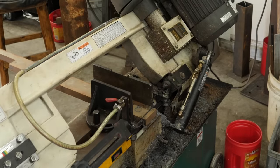Now that the guard is fit, the next thing to work on is the handle. We're going to make a frame that goes around the tang on the top and bottom of the handle — a quasi-isotropic carbon fiber piece sandwiched by a piece on each side of it. I need to decide how thick the two scales are, mark them out, and then go bandsaw them off.